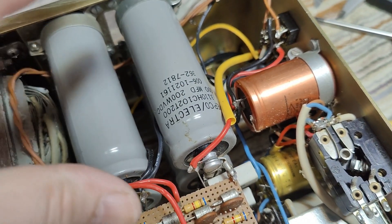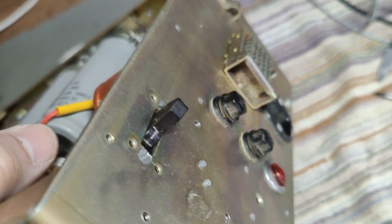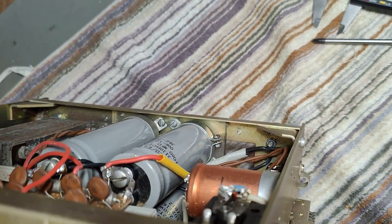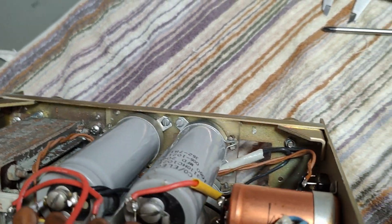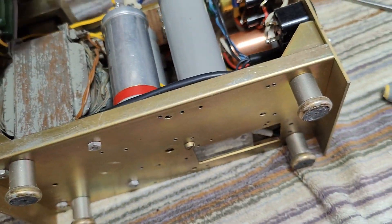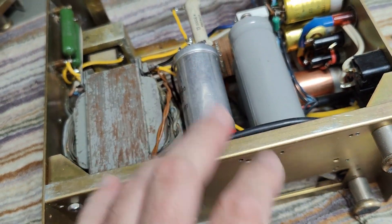Without any relays or protection or anything like that, the voltage goes straight from the capacitors to that connector. You could easily touch this — nasty, nasty. The capacitors are mounted on a plastic base, but the distance to the chassis is just too short — it's barely touching on the left one, and barely touching the transformer down there. The screws actually do go into the plastic and don't go through, so there was an idea about isolation, but it's not meant for all that high voltage.